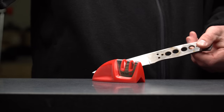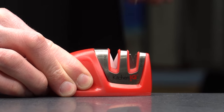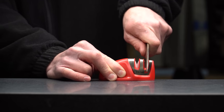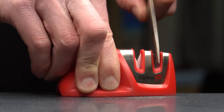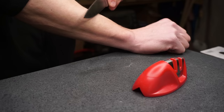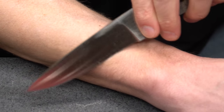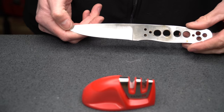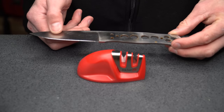I don't even know whether or not to try the last one at this point, but I guess we will — why not. That sound is horrible. So this is 1084, a high carbon steel with very low carbide content, but it's relatively hard — should be in the neighborhood of 62 Rockwell. Look at that — technically, that's shaving. This knife had absolutely no bevel on it in the first place, and this little most-reviewed knife sharpener on Amazon technically sharpened this knife. I don't know if you can see that bevel though.